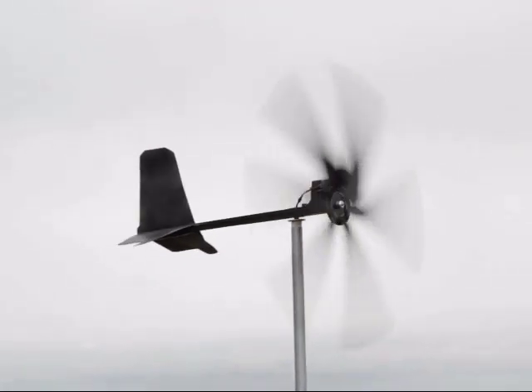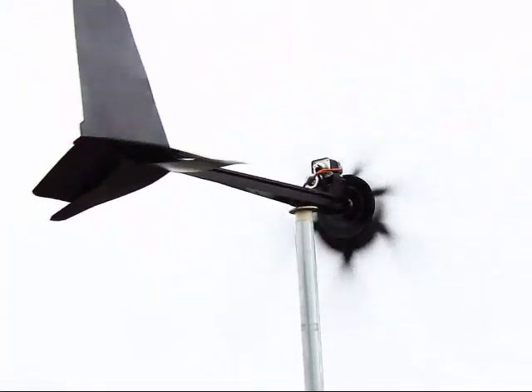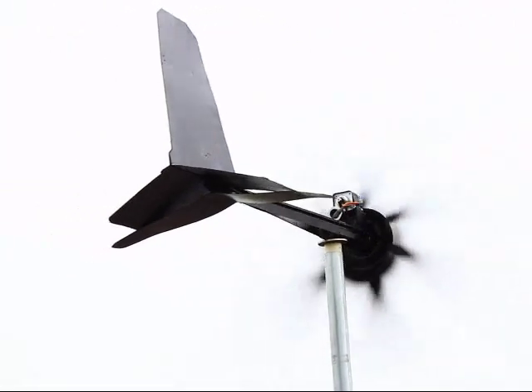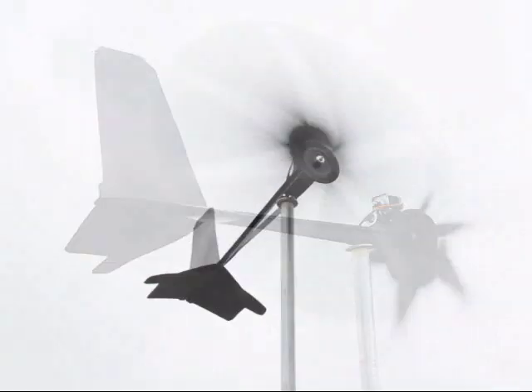You can see I've added a little extension to the tail. I put 18.5-inch steel-banded PVC blades on it, which is my own process — you can check my channel for that. It needed a little more tail to track properly, so I bent out another piece of steel and just spot-welded it on there.